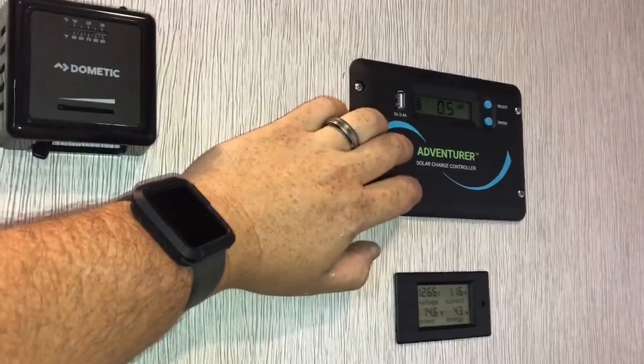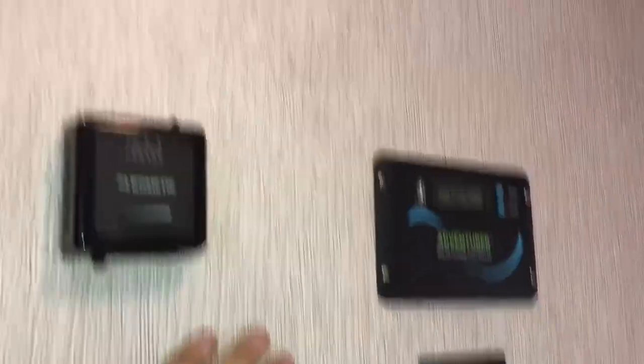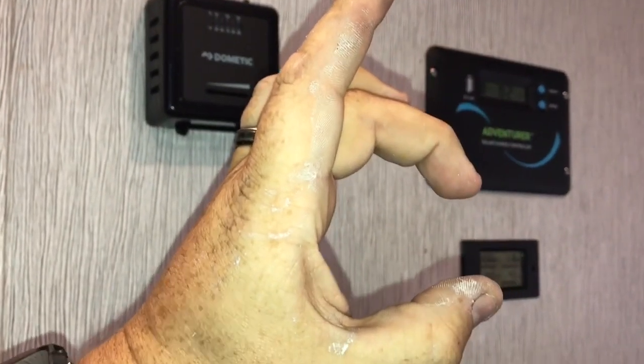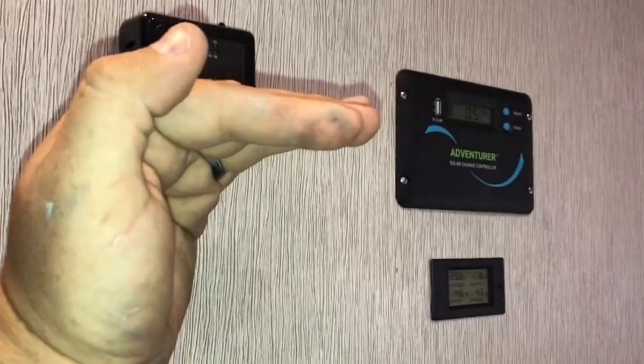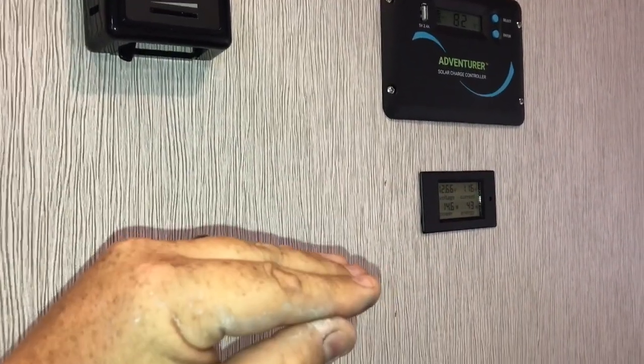I was able to slide in and get to this point. Using the pipe on the other side as my marker and navigational point, I went up and basically drilled a hole in the top. I had to make a hole about the size of a half dollar to get the end of the drill in. It was actually two holes, half-inch in size, to get the actual cables in. The problem is it's rubber, wood, big thick foam, and then there's a metal sheet of some kind, and then more wood underneath, and then another wood beam. So you have to get through a big thick layer of stuff before you actually get into the little cavity. Then once you do, it's just a straight shot right down to the charge controller, and I was able to get the cables directly in.